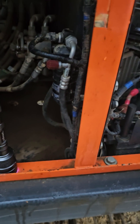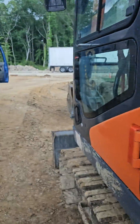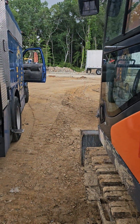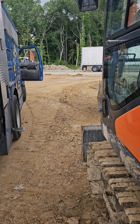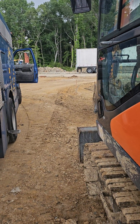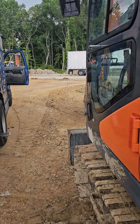I told them what's going to happen. I'm going to attempt to find the leak — do the standard procedure when I show up — and that's to charge it up to 300 psi with the nitrogen, run a deep vacuum, listen for an audible hiss, and also see if I could find the leak with the vacuum.